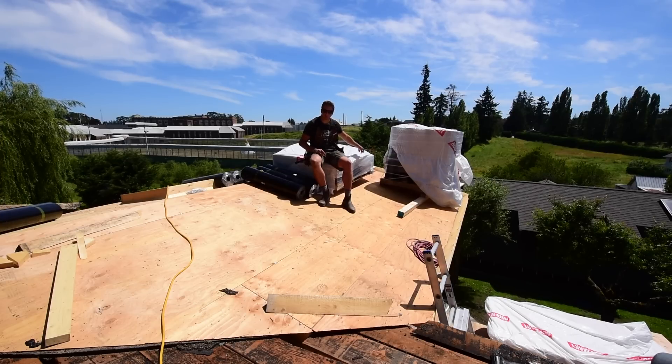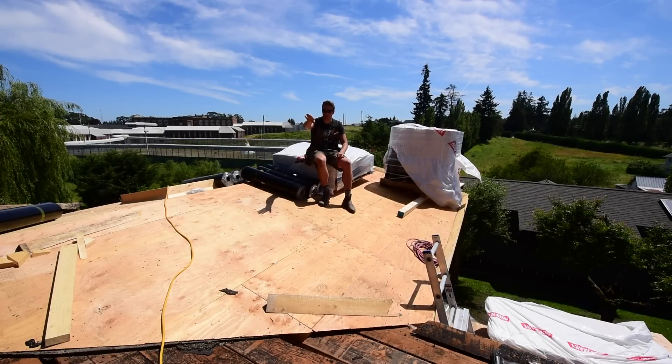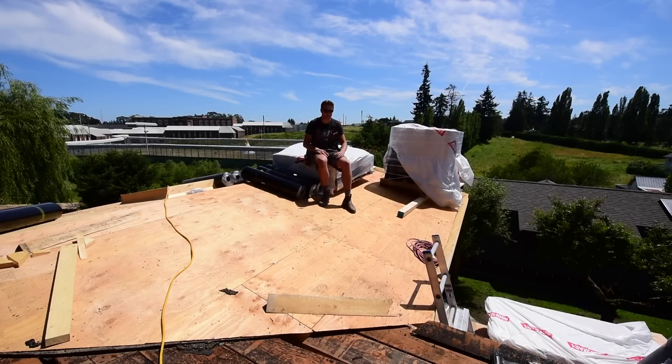Even the beam over the window — I've still got my quarter-inch gap on top so the beam's not deflecting at all. She's sturdy. You can see my eave, if you stand down below, is bending a bit at the corner where it has the least support, but I'm quite pleased with how the roof is putting up with this much weight. I've got another 500 pounds in the valley — these rolls are easily 100 pounds each. When I walk on the existing house roof, the 2x4 trusses have about a 10-foot span with no webbing and it bounces. But if it lasted since the '70s, and survived the blizzard of '96 with three and a half feet of snow without collapsing, this roof is going to be a-okay.